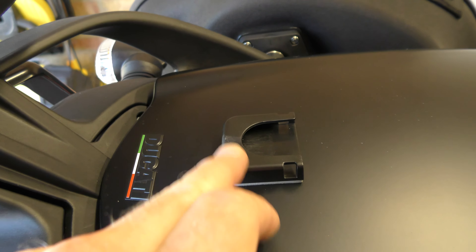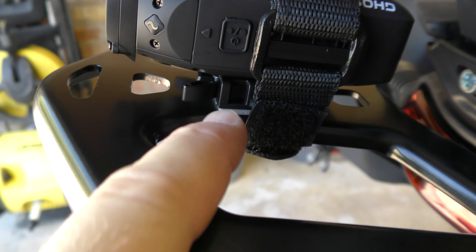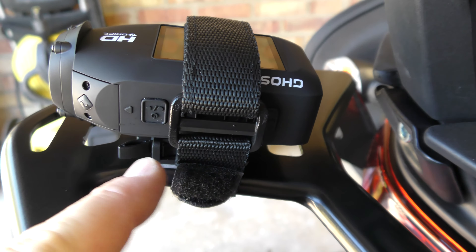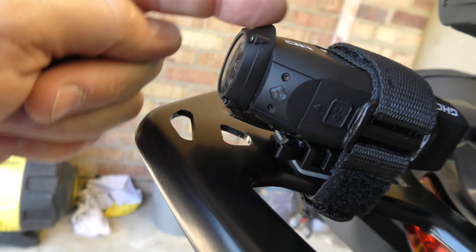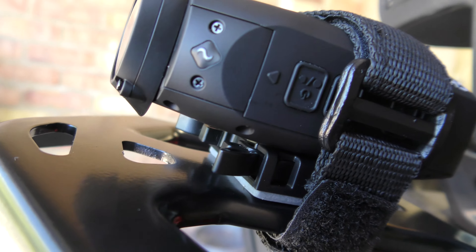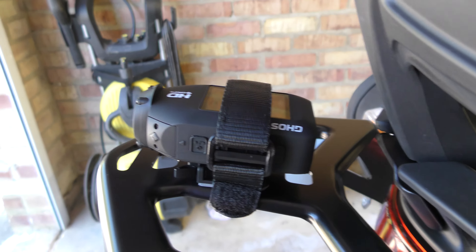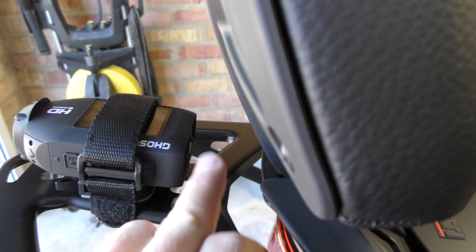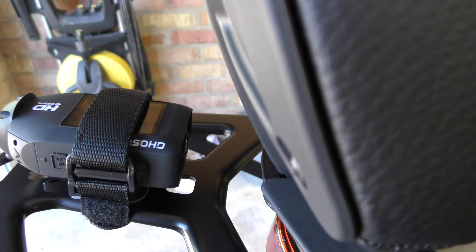There was an interesting issue with the way I mounted it originally. I don't know whether you can see all these marks in the plastic. It turns out — and I couldn't work out what was doing that — I had this mount reversed. So this release mechanism was round the other way. What was happening is I pushed the camera in, and the front of the lens, because it's been spun around, was actually sticking up above and below the body, and it was just fouling on here.